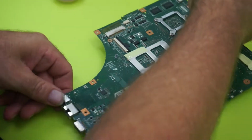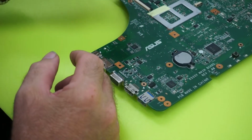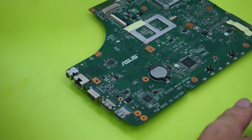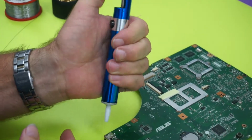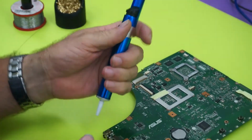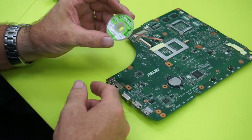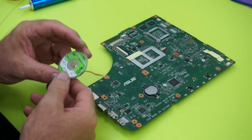We're just going to unsolder this and put a new one in its place. The tools you need here is a solder sucker. It's sucking up your solder off the board. So this tool will suck the majority of the solder off, and then we'll get some solder wick and clean up the solder, clean up the legs so we can just take the jack out.